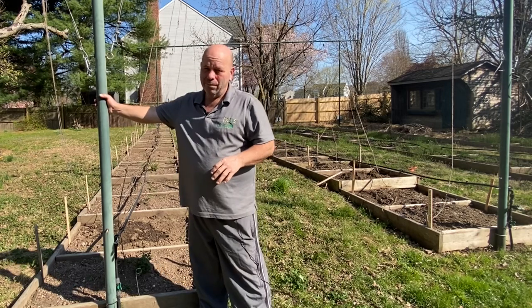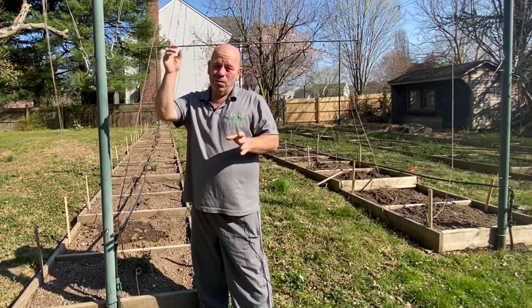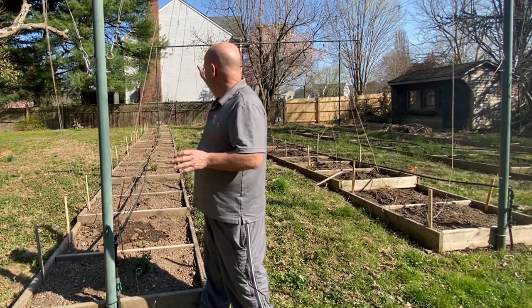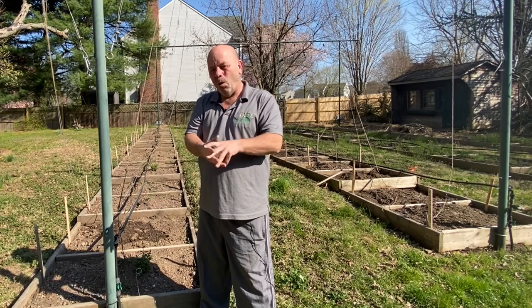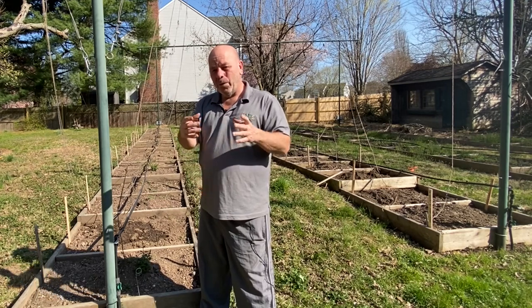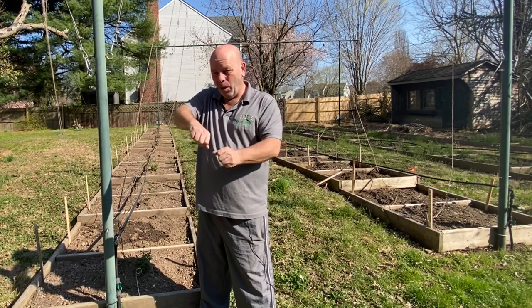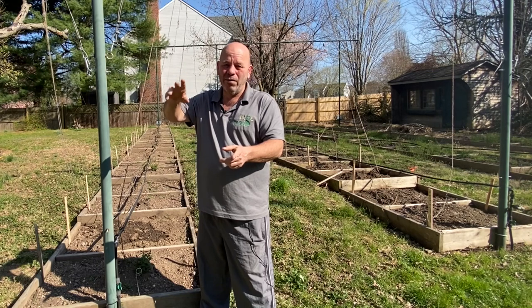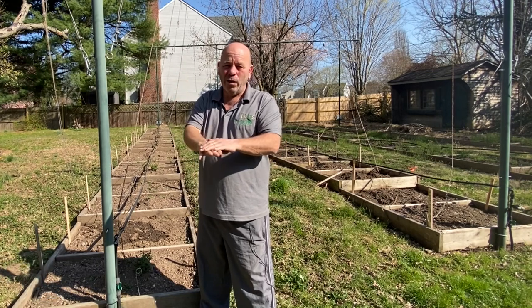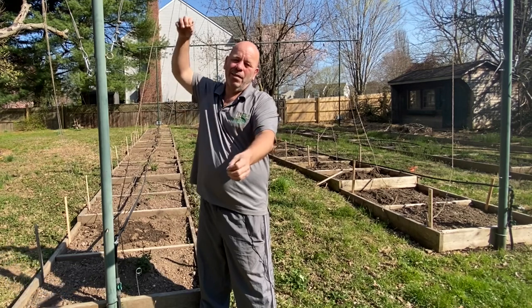So it's super sturdy. The anchor wires that you can't see here, there are some on the other end, they go down, and what I did was make a hole about 3 feet deep, and I put a chain and left it sitting like a snake in the bottom of the hole, and left the chain coming out about a foot, foot and a half, and then filled it with concrete. That way I could hook anywhere along the chain.